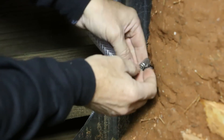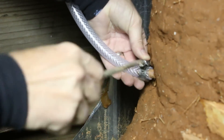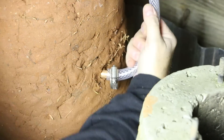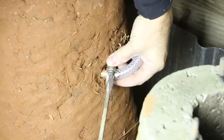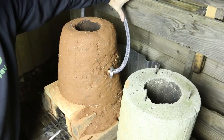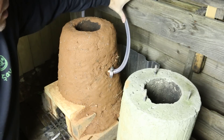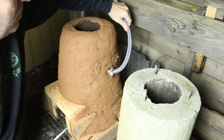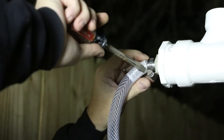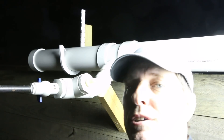Back on the stove side, now I'm going to hook up the water lines. I hope I have enough hose — it's the lower end, the cold side. Definitely a much more snug fit than that garden hose. And now the hot side. The hose is pretty tight here — I can always adjust the location of the tank, but for the purpose of the test this will work. I may have to put a heat shield back here to keep that hose away from the fire. Now I'll connect the hoses to the tank — the hot side, I barely had enough hose for this.